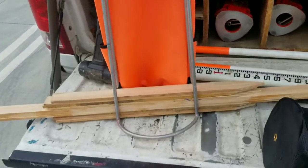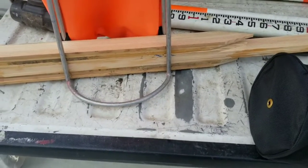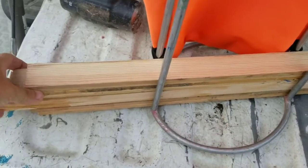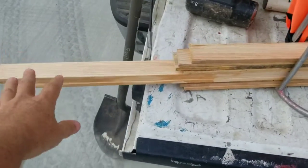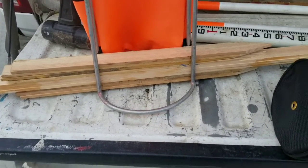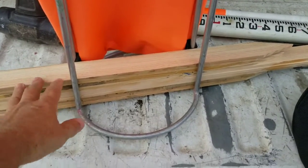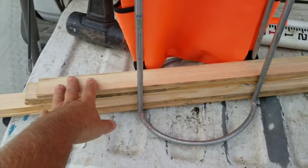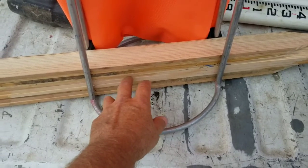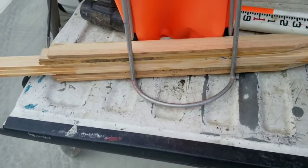The pros of a lath rack — there are a couple things. You can put different size lath in it and keep it organized. Back in the day we used to pre-station a lot of our lath. If we were staking sewer and doing the main line with two-foot lath and the manholes with four-foot lath, we could pre-station everything and put the lath in the order we wanted.